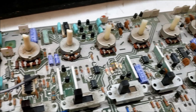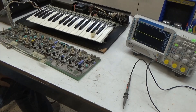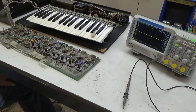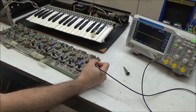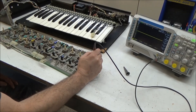Doing a visual inspection of this board, one thing I noticed that's kind of unfortunate — this octave selection switch seemed a little loose. So that's not good news. Since we have no audio output when the synthesizer is in bypass mode with the oscillators on and the noise source turned up, obviously if we don't hear an oscillator we don't hear the noise source either. A good place to start looking would be at the VCA, which is located here — it's chip IC601. We'll look at the input to the VCA on pin 2, and we should have a 40 millivolt peak-to-peak signal there, but we have nothing.